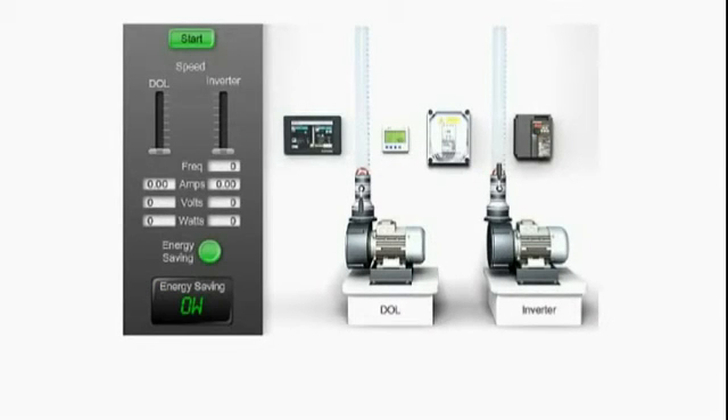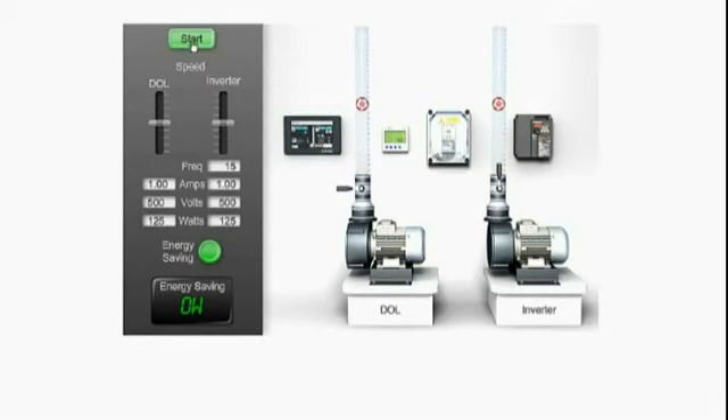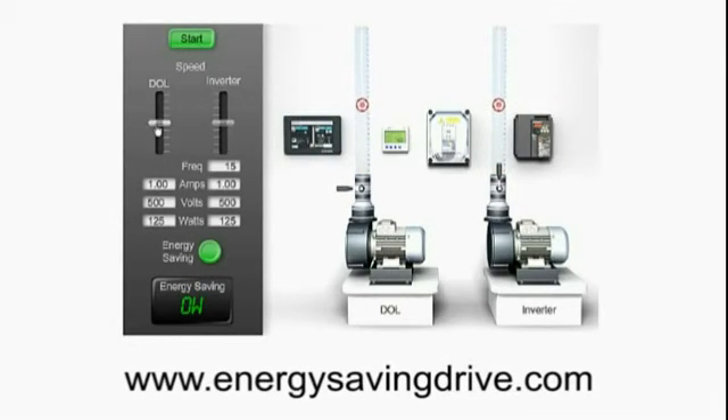This has other benefits: if the motor is only getting just the amount of current and voltage it needs to rotate the shaft, there is no wasted heat. In practical demonstrations where we run an OEC motor versus a straightforward inverter-controlled motor, the skin temperature after 15 minutes is half. If you would like to experiment with energy saving on fan and pump applications using the technology shown today, please go to our virtual system online. Thank you very much.